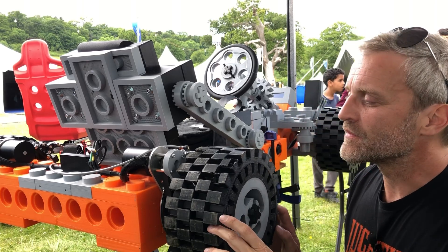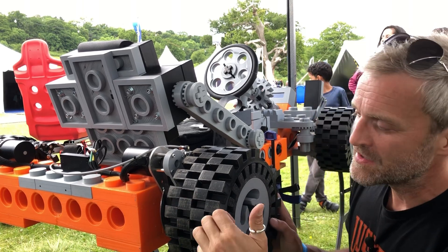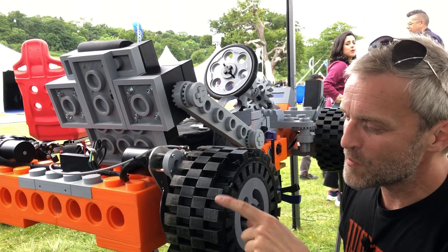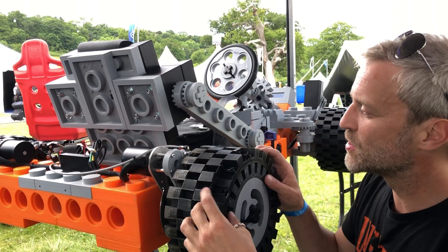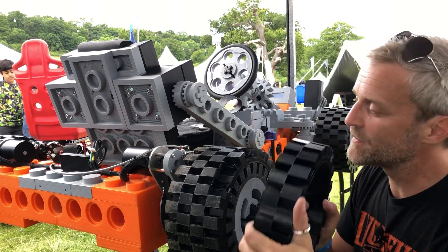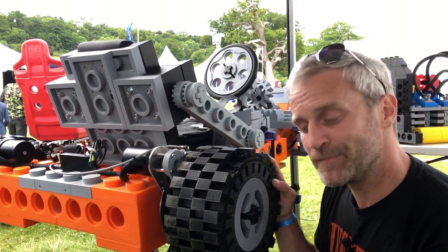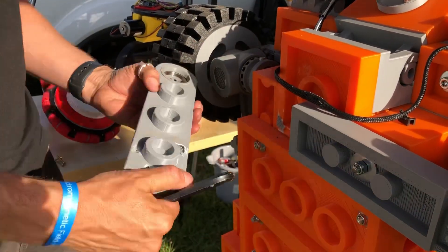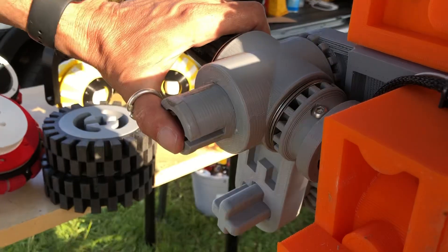Clearly that didn't work well. There wasn't enough torque to get moving uphill, and then I stupidly took it on the flat tread surface, revved it up, and shredded the wheels. When I printed these extensions I'd only used two perimeters, so they're way too weak. I'm going to take off the two damaged rims — fortunately only two are damaged — and put on the rubber ones instead. If that doesn't work, I'll go back to the original tyres and hope 20mm of ground clearance is enough. But it wasn't — I tore the bottom of a steering arm off. I've glued it back and I'm just hoping for the best. Unfortunately, I forgot to bring a 3D printer.